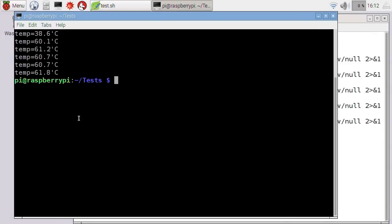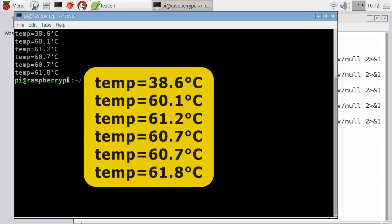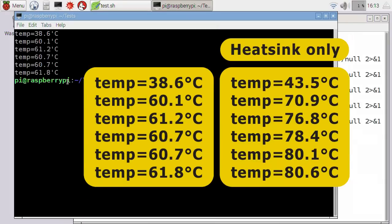And there we are, it's finished — quite a good set of results. Comparing those results to results I achieved last time just using the heatsink on the Pi but with no fan, we've got a fall in the idle temperature of about 5 degrees centigrade, and a fall in the overall temperature of about 20 degrees centigrade at load. It quite quickly settled down at around 60 degrees centigrade. That's a very good test with this makeshift fan. We now need to see if we can make something even better that properly fits on top of our Raspberry Pi 3.